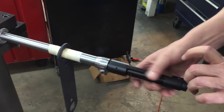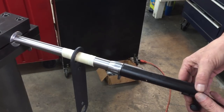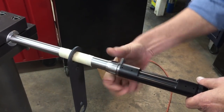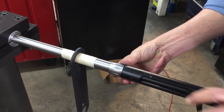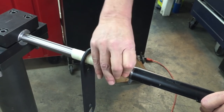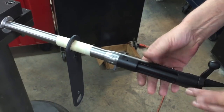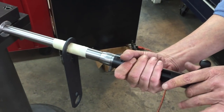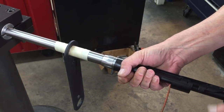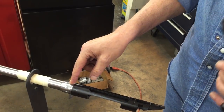What we're going to do is screw the action in gently until the nose of the bolt touches the bottom of the 705 counterbore. There we go — the bolt is held in place. You don't want to screw this in tight, so just back it off about a quarter of a turn and the bolt moves again. The face of the bolt was touching the bottom of the 705 counterbore in the barrel.